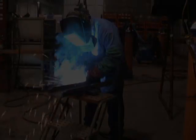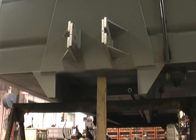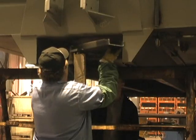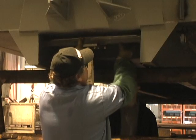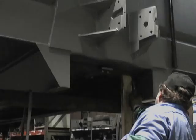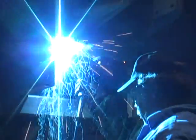In our example, the welder uses a hydraulic jack and a 2x4 to hold the C-channel assembly in place while he tacks the C-channel first to one spine and then to the other. Any safe fixture can be used. Full welds are then applied. In addition, while welding the bracket to the underside of the body, the welder takes the opportunity to prepare for the truck wiring by welding the rigid metal conduit in place. This conduit runs the length of the body for lighting and any other electrical items at the rear of the body.